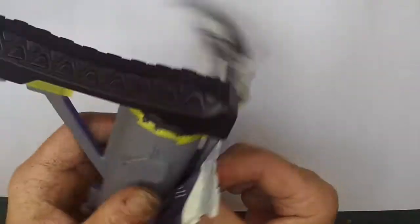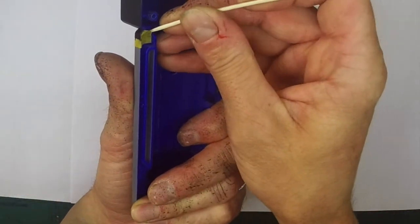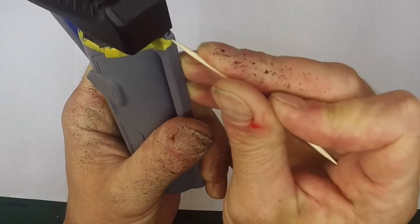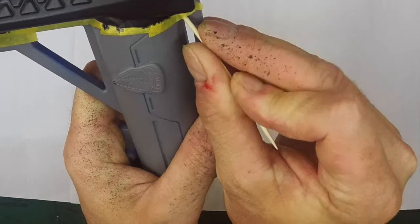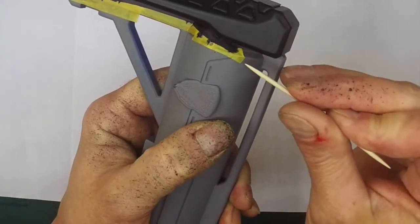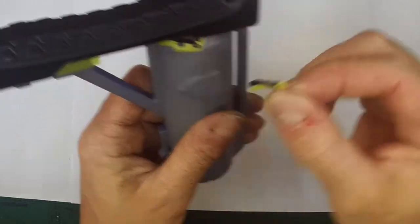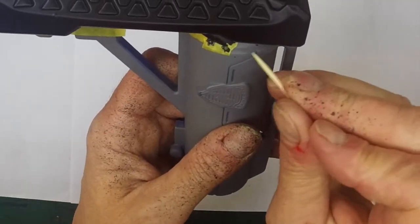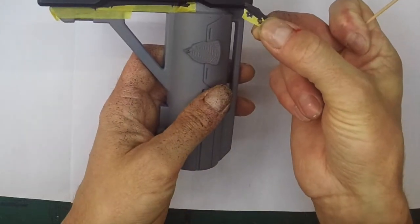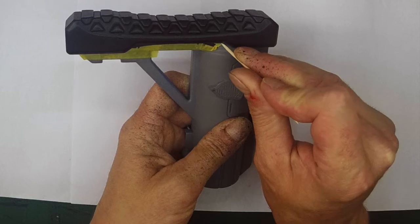So a little bit of patience. We can take that away and get in under an edge. This is where the cocktail stick really comes into its own — I can just work it to get hold of the paint and get hold of all these little bits. You can see that is now giving a really nice clean edge. The black was rattlecanned because I very rarely bother with small pieces — it's not worth loading the gun for a little bit like this; it takes an hour to clean it all afterwards. You can see that we're not actually damaging the primer finish underneath as we do this. Be careful — if there's any damp paint on those bits of tape, keep it separate from your piece. Don't let it touch the furniture — that will make you unpopular.